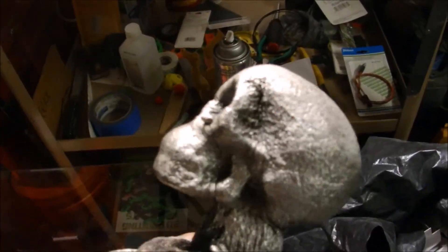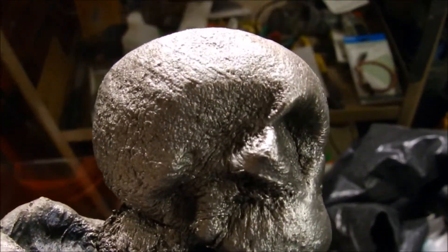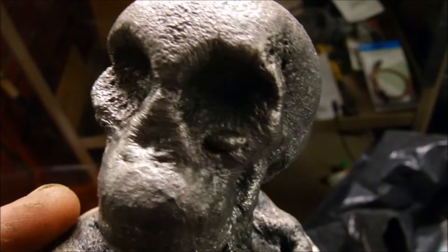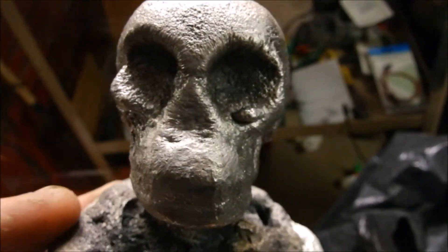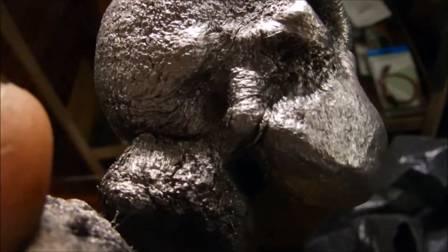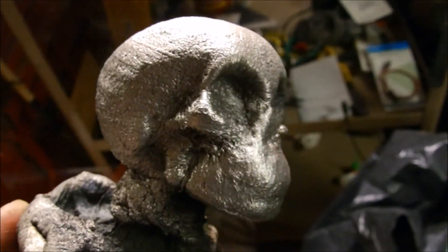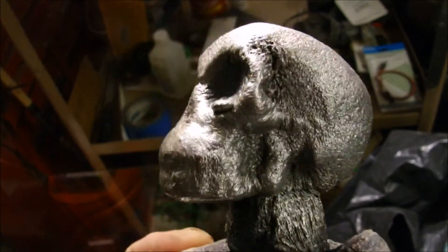This is after I hit it with a little wire brush — it came out of its tin can. I didn't expect a perfect finish because like I said I just buried it in sand and melted the plastic away. You can see right there in his eye — during the actual print there was a hole that was made, and I thought I was going to fill it in with something when I made a mold, but I didn't make a mold, I just experimented. Molten aluminum versus PLA — I think molten aluminum wins.